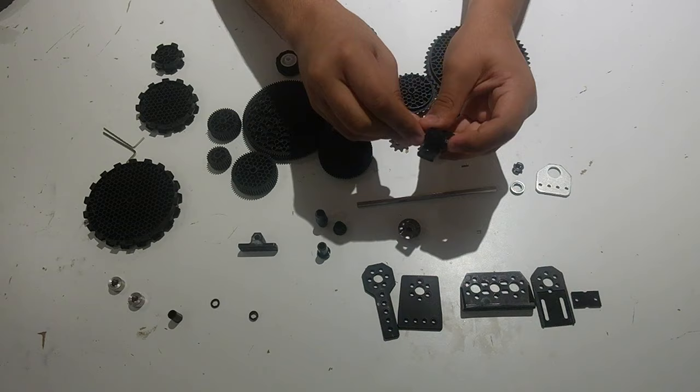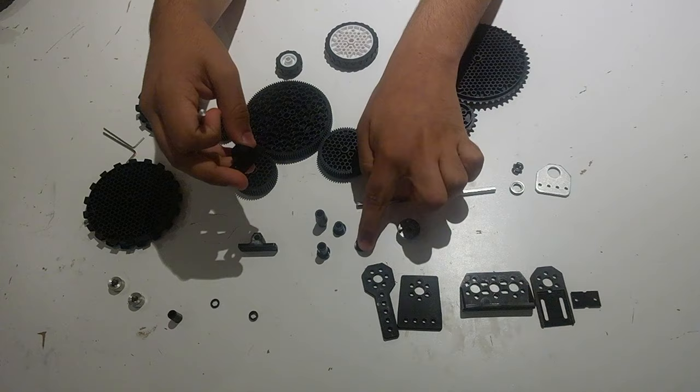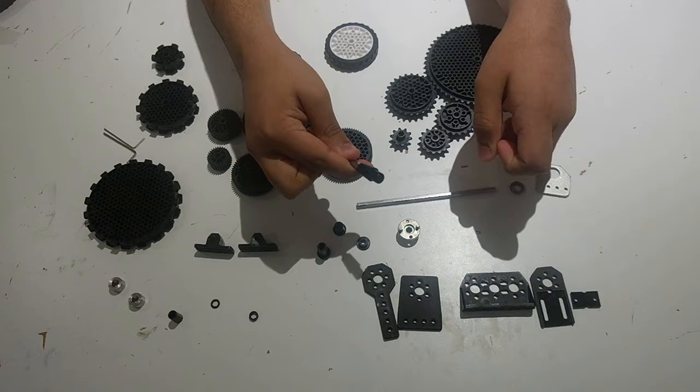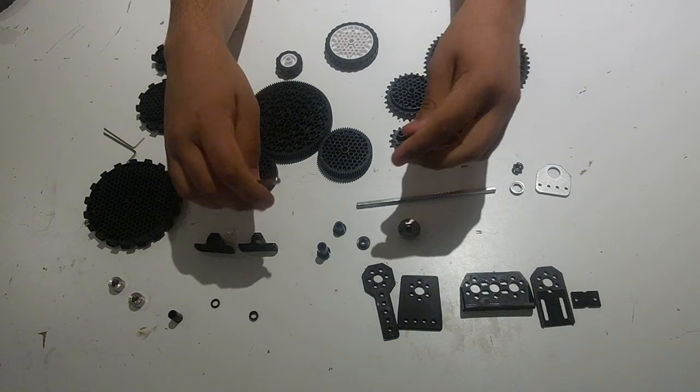We have three types of bearings like this: the short throughbore bearings, the long throughbore bearings, and the end cap bearings. The end cap bearings are a little bit different, as they act as an end cap to your hex shaft, meaning that it can't stick out. This helps if you're trying to constrain something laterally along the shaft, as it makes it a little bit easier.